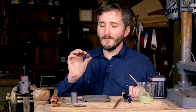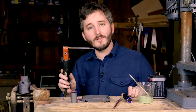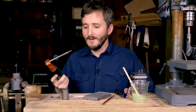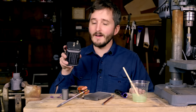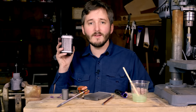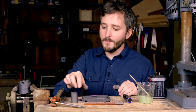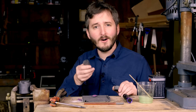This is the largest ruby I've been able to make with this process. To do this I'm using a carbon electrode in my arc welder — an extremely heat resistant material. These carbon electrodes are sold for arc welders; I found mine on eBay, a 50-pack for about $20. Previously I had used carbon rods scavenged from old-style 6-volt lantern batteries, which also work well but require cutting the battery apart. I also use a piece of graphite as a crucible. I started with a piece of round stock graphite — you can buy graphite blocks, rods, or crucibles all over the internet.